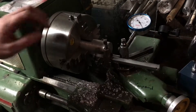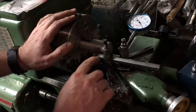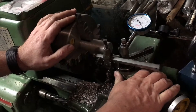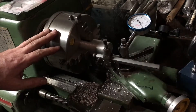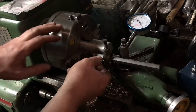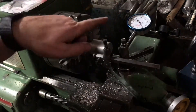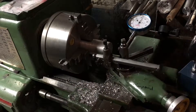Here's the setup. Got a dial indicator zeroed with the tool bit touching the workpiece. I've tightened all my gib and grub screws down to take out any play, I've locked down the travel, I've choked up as much as I can on the bit. I'm going to stop at 76 thousandths in depth — that should be the depth of the ring, and my cutter is as wide as the ring needs to be.